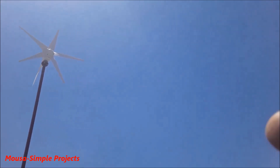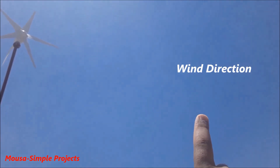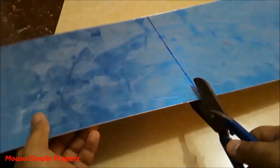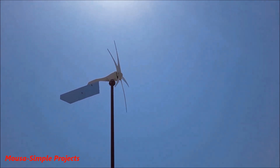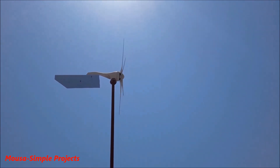After a few days I found that the wind turbine could not track wind direction properly. The reason is that its tail is very small. So I added a piece of aluminum plate to the tail and tightened it with screws. After making this modification, the wind turbine tracked the wind much better than before.